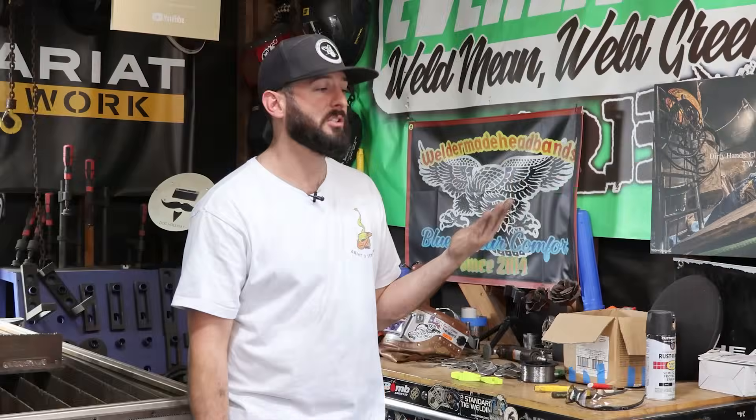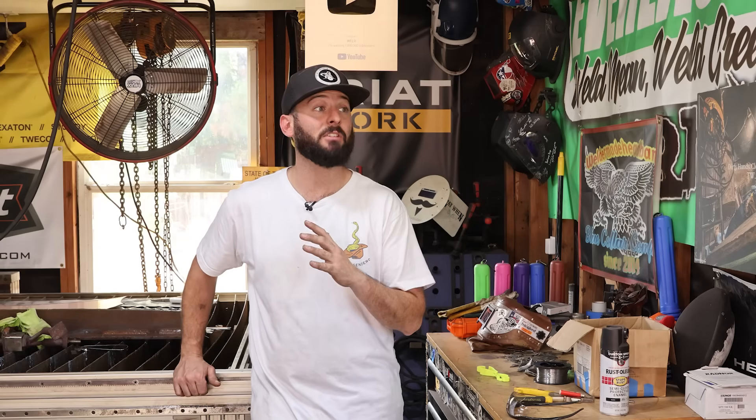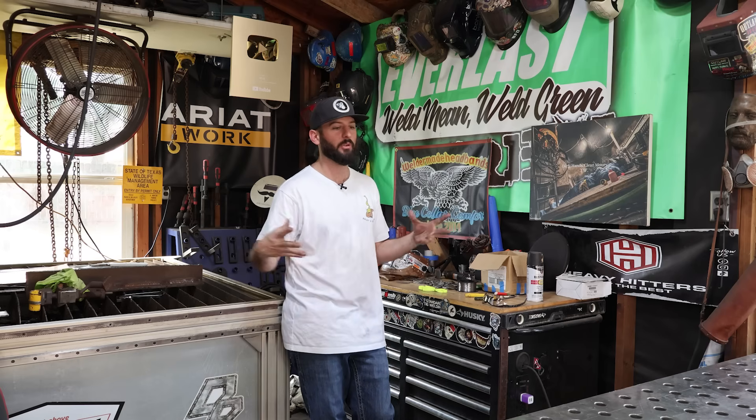If you have a multi-process machine, you'll need multiple types of consumables, and that one drawer alone can cost more than the Sprinter machine. Plus you'll need welding gas for MIG or TIG, and oxy-fuel requires torch bottles. For buying consumables on a budget, the safest route is to go to the machine manufacturer's website or their distributors — it's a bit more expensive, but the quality and consistency is much better than Amazon. I bought plasma electrodes on Amazon thinking I was saving money, getting double the amount at half the price, but eventually one stripped the torch head and I had to buy a whole new head.